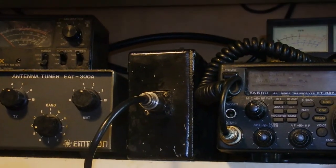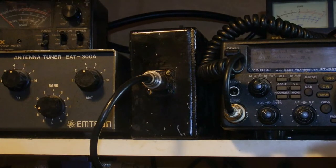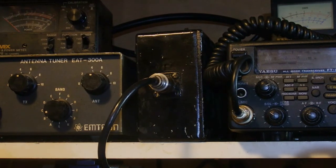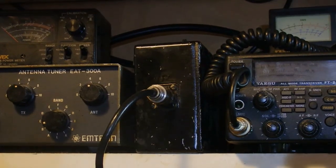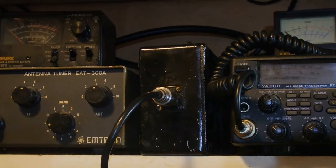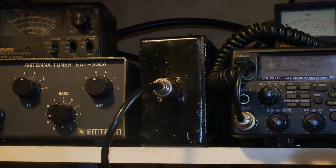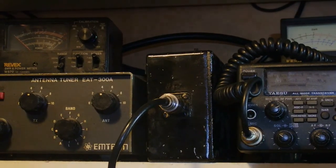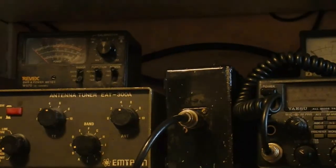We used to have television in a band going from low VHF to high VHF, something like 40 to 180 megahertz, and it was quite easy to cause interference in that band to television transmissions. So this elliptical filter was tuned to the old TV1 and TV2 frequencies. I'll take it down in a minute and show you the inside. From the filter, we go to the transmitter.